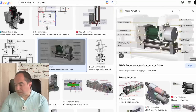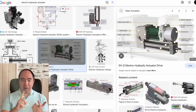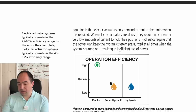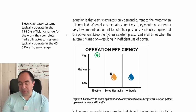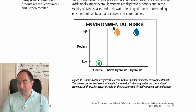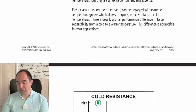Electro-hydraulic actuators are a small self-contained package including motor, pump, hydraulic piston, valves, and all controls in one easy-to-use unit. On efficiency: electric actuators typically achieve 75–80%, which is quite high, while hydraulic ones achieve only 40–55% — almost two times lower. This means that for mobile robots, electric systems are probably better than hydraulic ones. From an environmental risk standpoint, the electric system has low risk, while hydraulic systems carry high risk due to the possibility of oil leakage.